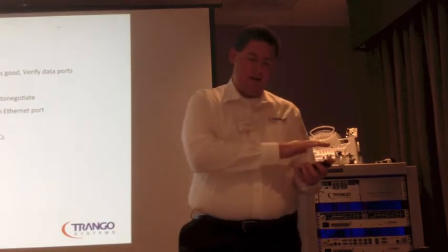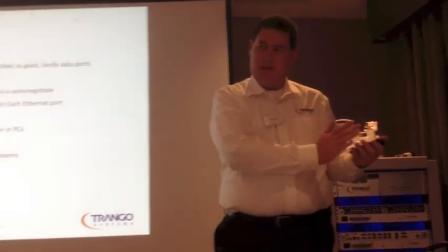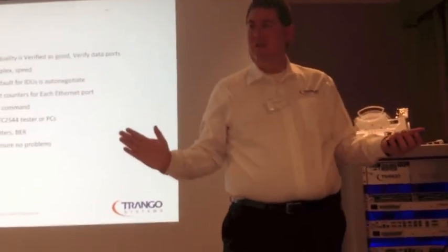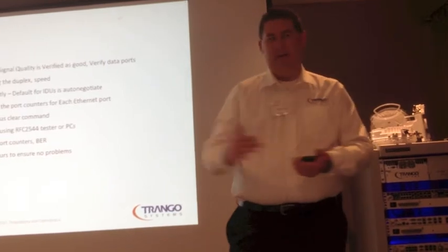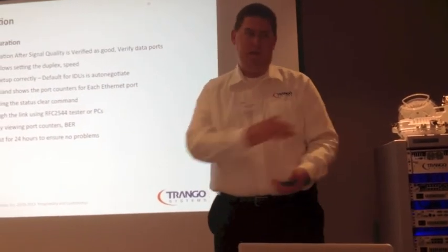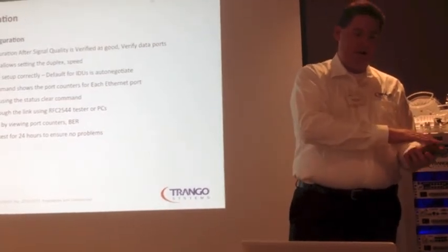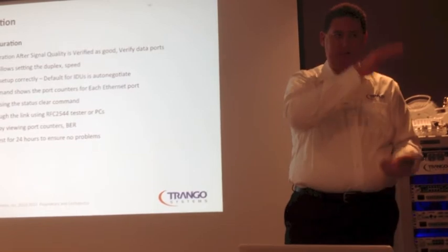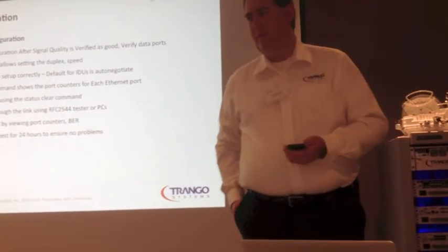So we take that gigabit burst that comes in for that first tenth of a second, we're able to get 30% of it across the link, we buffer maybe another 30% of it, and now we only get 60 megabits across the link because it was bursting. If it sent it, you know, for a tenth of a second and then waited, and then a tenth of a second and waited, and a tenth of a second and waited, shorter time periods, it would work better.